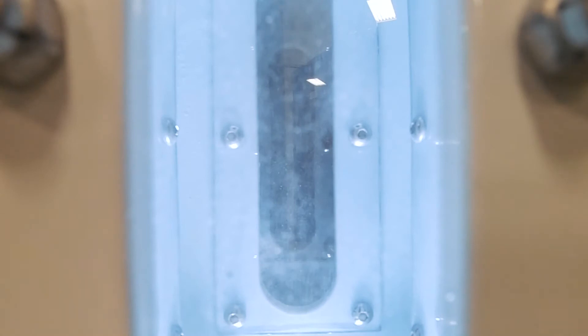Conair's Truefeed micro feeder was designed for very low rate dosing applications. For injection applications it could dose one pellet per shot; for extrusion applications it could dose five pellets per second. It's made for the very low end where a gravimetric system isn't capable of dosing at such low rates, so we're talking very low tonnage injection machines or very small barrels for extruders.